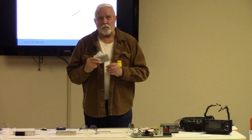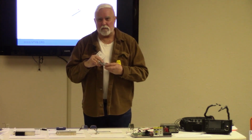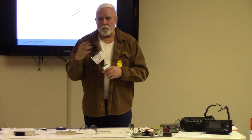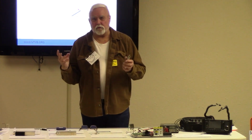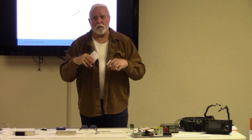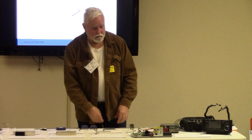And on 47 gig, it only has to be quadrupled. So you see, it's the game of multiplication. Every time you multiply the frequency, it gets dirtier, and you get more noise included in the multiplication. So, folks, there's a market for that because of that.